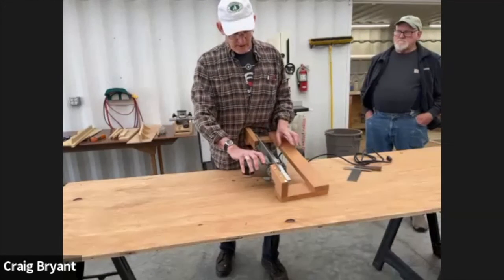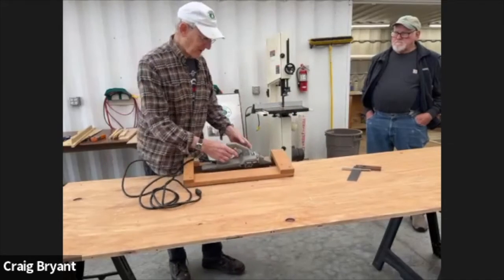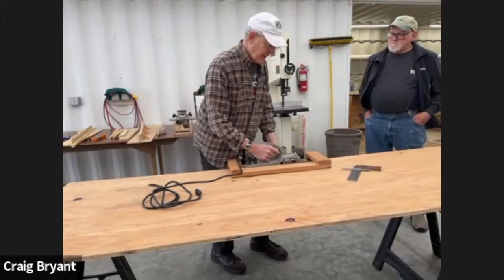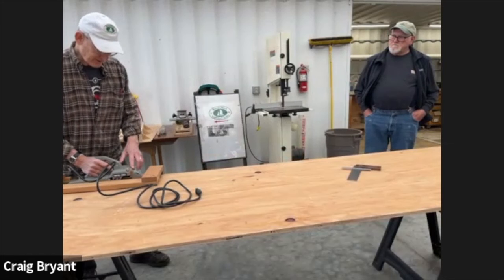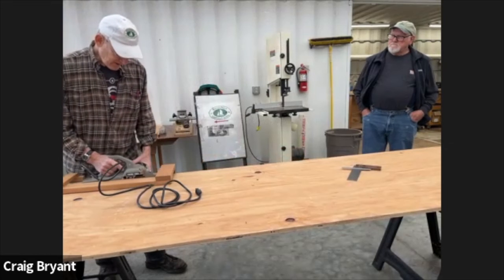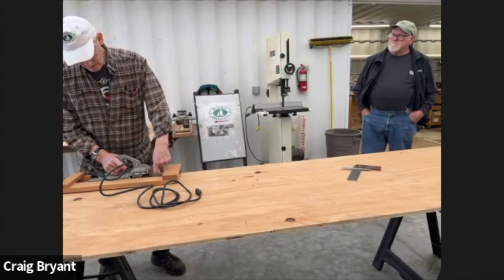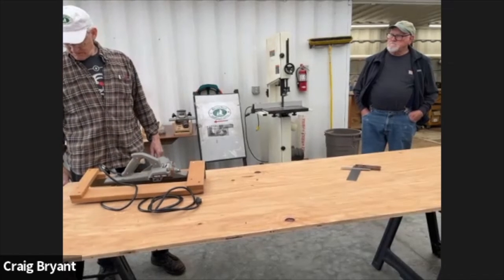So that's kind of nice. Once you have it, I came here with a piece of plywood, fully thinking I was going to make sawdust, but I guess it won't. You just put it up against here, pull the trigger, and away you go. You keep taking multiple passes, and it's set up for about a 32nd of an inch cut, and you can get less or more, but just keep going, and eventually you'll get to a feather edge, and you'll have your taper to the full width, and then from there you work with a hand plane to do the rest.